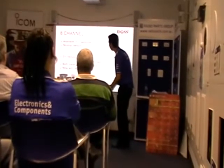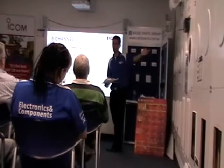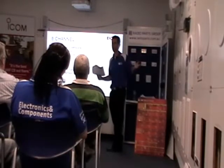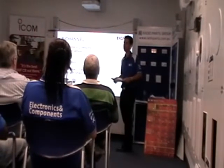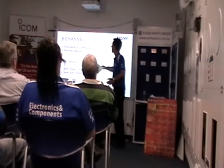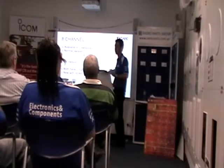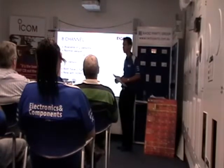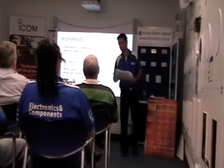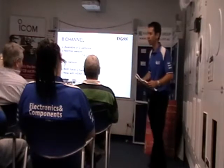It's not so much an Eco version, but there are 2 versions. One input might go up the other end of the hi-fi room, if we're doing this area, and the other 6 channels might be outside. You don't need the resolution, you just need to know what's coming in and out, so you could use that. And there's also a D1 version, which is fully 8 D1 channels, so you record in better resolution. They both have 2 SATA hard drive bays, so you can put in 2 one-terabyte drives and record.